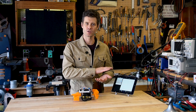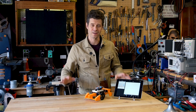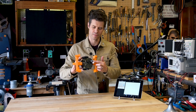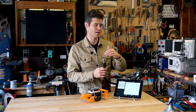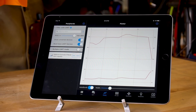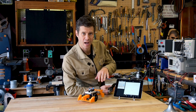You can imagine this would be useful in a real race car situation — going over hot tarmac and wanting to know the temperature so you can adjust for the correct tire stickiness. I can simulate the effects of the hot track on the underside of the car. I've got my sensor underneath the chassis, and if I use my hot air rework gun at a fairly low temperature — but a lot hotter than ambient, at 100 centigrade — we can watch the graph get hotter underneath the car. Here we can see the crossing of the two streams as I lowered the humidity and increased the temperature by blowing hot air underneath the car.